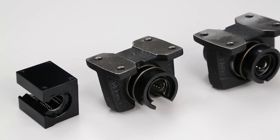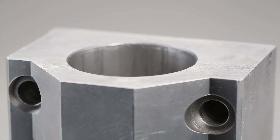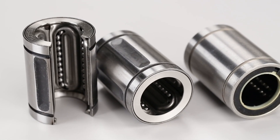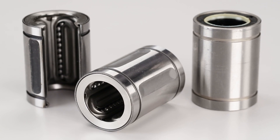For applications in which custom mounting is required, the linear bearings are installed into a custom bore. There are several methods for keeping or retaining a linear bearing in that bore. Linear bearings with a steel outer shell can be installed in a housing bore by a light press fit, since very little longitudinal force can be transferred to the linear bearing due to its free rolling characteristics.